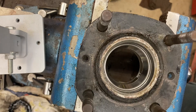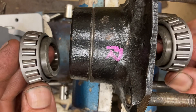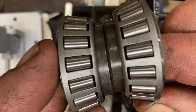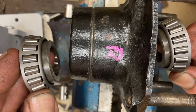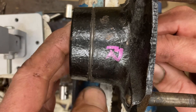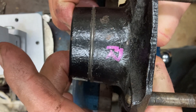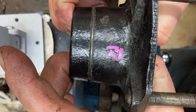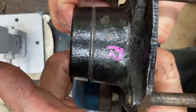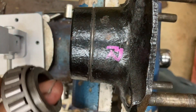Now try the bearings — just make sure that they meet in the middle with no play and no rocking. This is important. If you feel any play, now's the time to fix it. I've got absolutely no movement in there — any movement you see is just my fingers moving back and forth. I feel absolutely no movement in the bearings, so I'm confident that's going to be great.